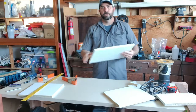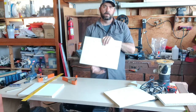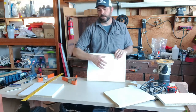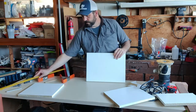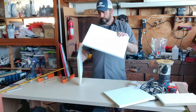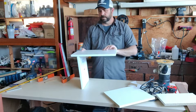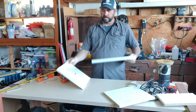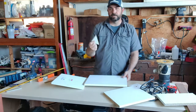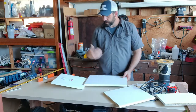We're all cut up now. We've cut our top here at 16 inches, so it's 16 by 12. I've gone ahead and marked the center location of the top plate. These are going to be our 12-inch legs — they'll sit on top just like that. And then we've got some extra pieces here for some simple blocking and squaring up, to make sure this thing stays square and stays rigid throughout the life of it.